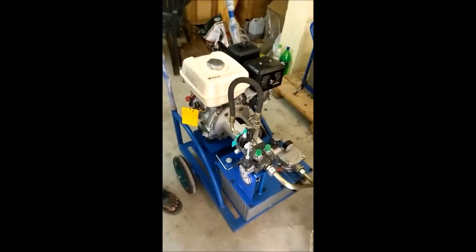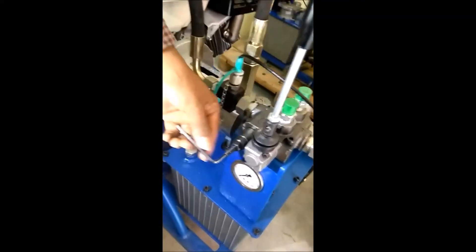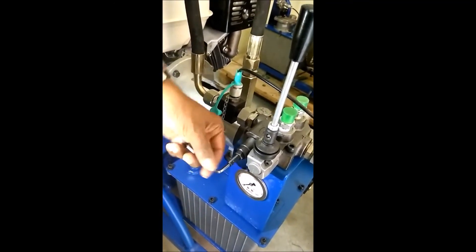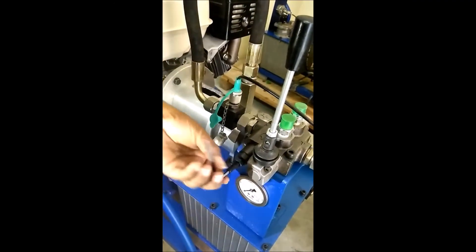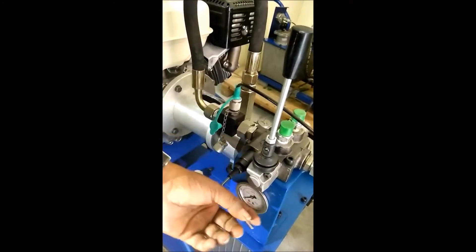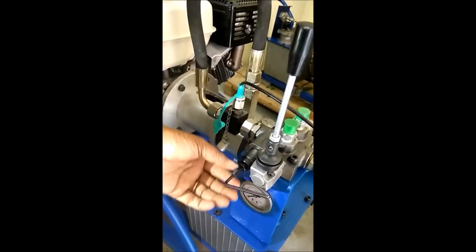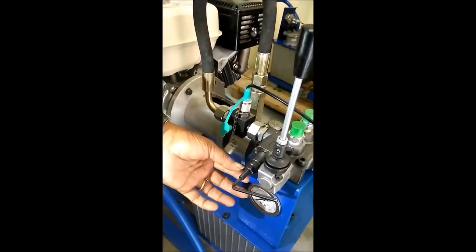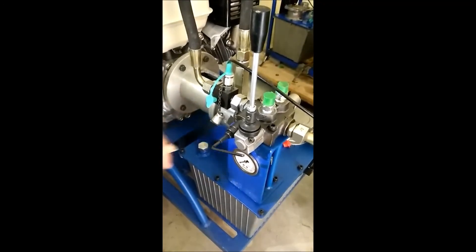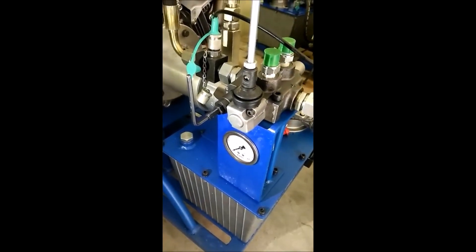Because you are using the weak cable, please keep the hydraulic pressure at 40 bar. Above this there is one small check nut. When you loosen it, it will decrease the pressure. When you tighten it, the pressure will increase. You can increase or decrease the pressure according to your requirement — this applies for present use and future use. Tighten it to increase the pressure; loosen it to decrease the pressure. Watch this meter — it will show 40. For the present requirement, keep it at 40 bar.